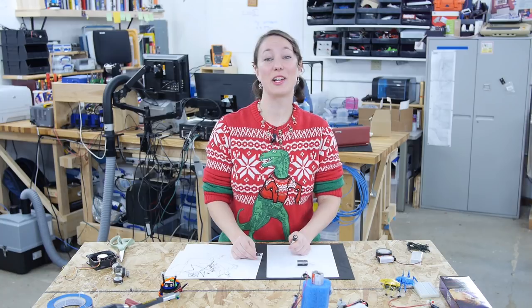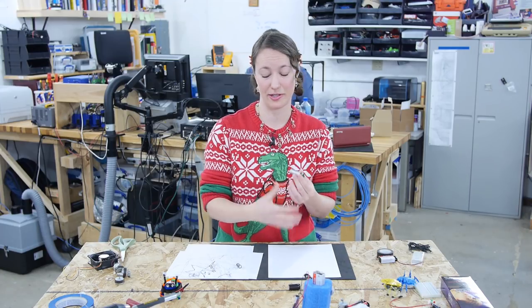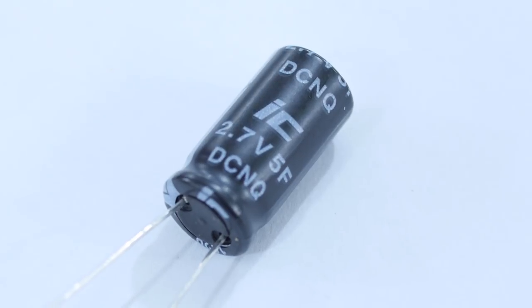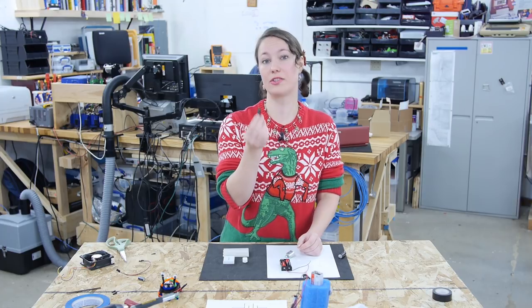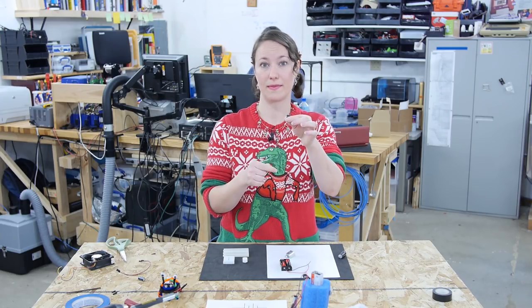We're gonna add a capacitor. A capacitor is a little like a battery. Although they work in completely different ways, capacitors and batteries both store electrical energy. Batteries have two terminals — chemical reactions inside the batteries produce electrons on one terminal and absorb electrons on the other terminal. Capacitors cannot produce electrons; they can only store them. Capacitors usually have two ratings: voltage and Farads, which is the unit of measurement of capacitance. For our project we want to select a capacitor that is rated for approximately the voltage we'll be using and has high capacitance. I selected a capacitor that's rated for 5 Farads and 2.7 volts. In this new circuit we're going to replace the battery with the capacitor. However, the capacitor only stores energy, so how do we get energy into it? We have to design our circuit so that we can hook up batteries to just the capacitor to charge it up, and then be able to connect the capacitor to the motor.